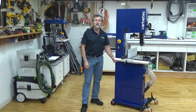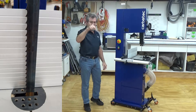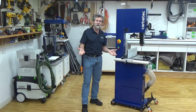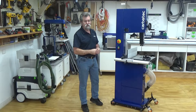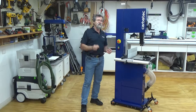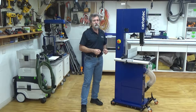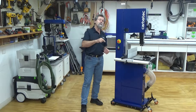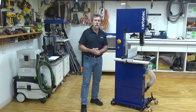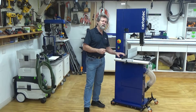Operation and safety: the blade cuts in a continuous downstroke. For best results the blade must be sharp. Select the right blade for the job depending on the thickness of the wood and the cut to be made. The thinner and harder the wood, the finer the teeth of the blade. Use a fine-tooth blade for cutting sharp curves. Please refer to the maintenance video on how to change the blade. The machine is especially suited for cutting curves.